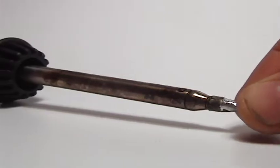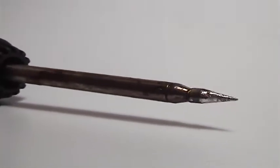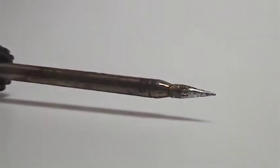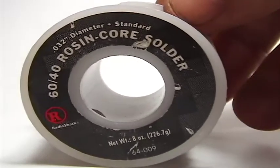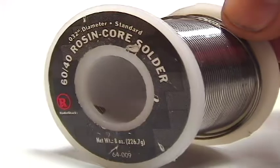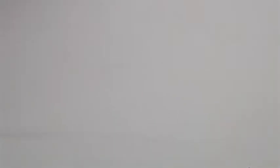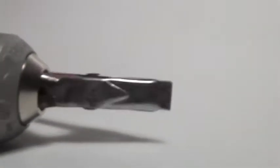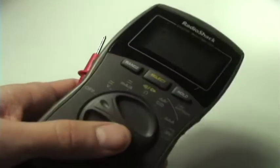Here's our soldering iron. I like to use a brass tip or a copper tip. You want to make sure the tip of your soldering iron is tinned. Now we're going to use a 60-40 solder — I like to use a small diameter. Now here's our clamp that we're going to use today; I like one with a sturdy base. And we're going to need either a cable tester or an ohm meter to make sure our cables are working at the end of the day.